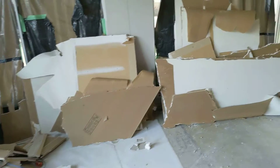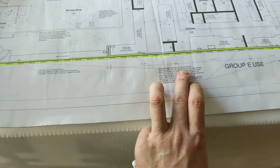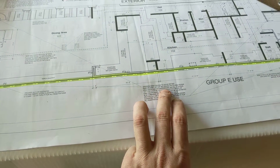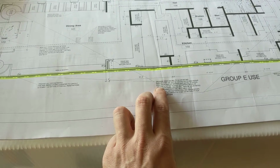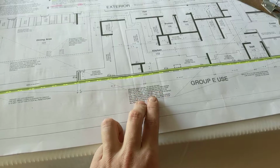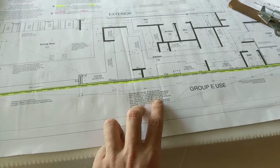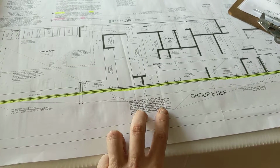And two, not one, but 2 layers of, what did it say? Yeah, half-inch, the same stuff I'm putting on the wall. This is their code. Remove existing half-inch and repair insulation vapor barrier. Install 2 layers of half-inch type X to existing strapping. This will then be 3/4 heat resistance rated.